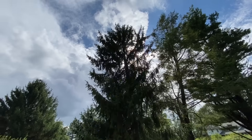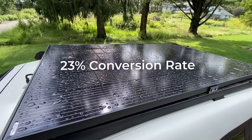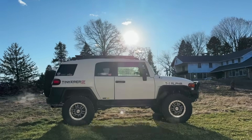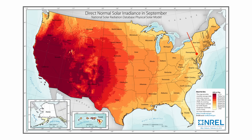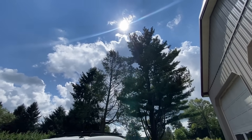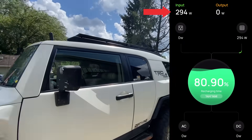Let's take a look at how much this 400-watt panel actually generates. This is a premium panel with a top-tier conversion rate, but there are three variables out of my control. The first one is solar angle. I installed this panel in early September, and I live in the northeast. So from September till now — late January — I never had great solar angle. The best power I witnessed was about 300 watts, which is 75% of the rated power. Honestly, that was pretty good given the non-ideal angle.